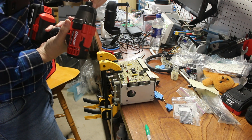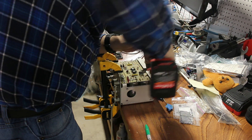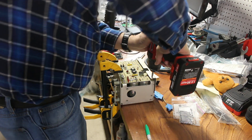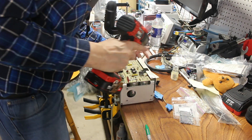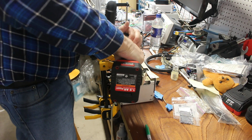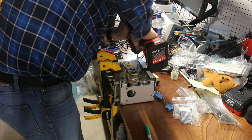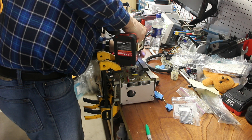The manual says to pull out the four screws that hold the board in place. A Phillips screwdriver didn't give enough torque to bust them out. I applied penetrant and tried the impact driver once the penetrant had time to work. Two of the screws backed right out, but the other two are well and truly frozen. Even another round of penetrant and more waiting didn't move them. Well, I won't let that defeat me — time to roll out the big guns.